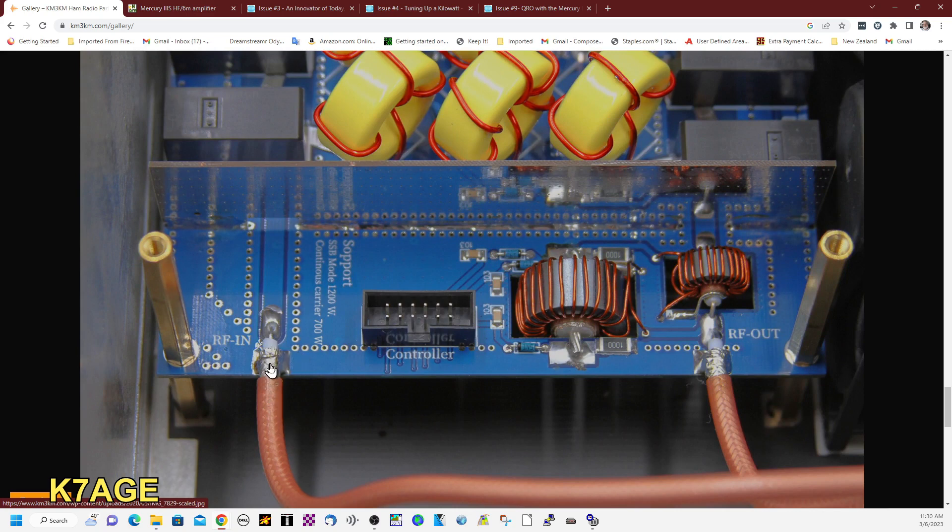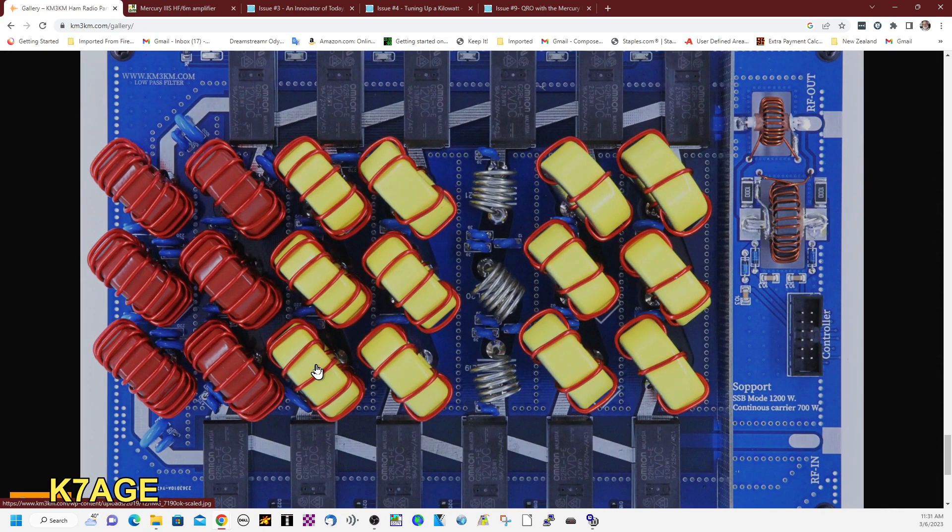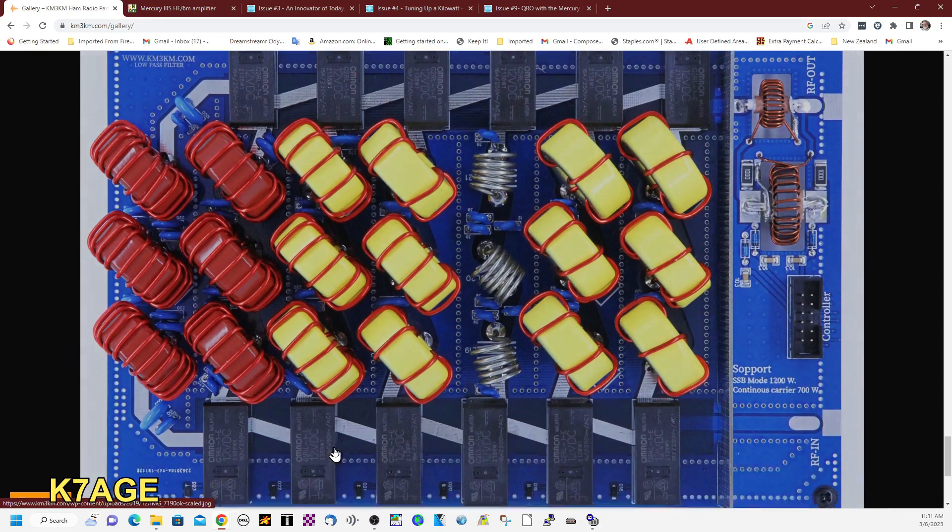Basically all the soldering required was to solder these coaxes on. This is Teflon coax, which is nice because it takes a lot of heat to get the braid soldered onto the main ground plane of the board, but since it's Teflon it doesn't melt. Some people had a hard time getting that soldered because of the massive area that sank the heat. They got them type-accepted and now only sell them assembled, so I didn't get the experience of putting this together. Here's a shot of the output filter with bandpass boards and relays on each side. So basically you get on the list and you wait.